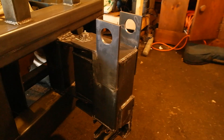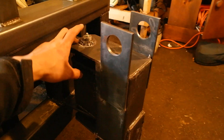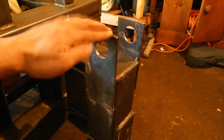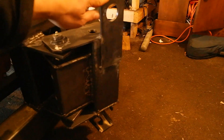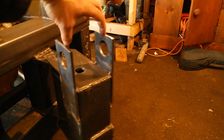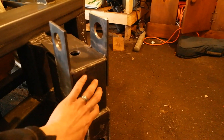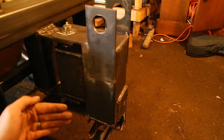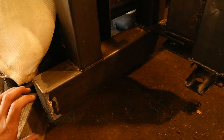Here is the slew mounted onto the subframe of the backhoe. Here's that one inch pin — there are grease fittings on top and bottom as well as down in the center. This slew is going to pivot in close to a 180-degree arc. The backhoe boom is going to attach right here. The cylinder that's going to mount to the boom attaches on the front right here, and the cylinder that controls the pivoting action mounts down here and comes over to mount on the backhoe.